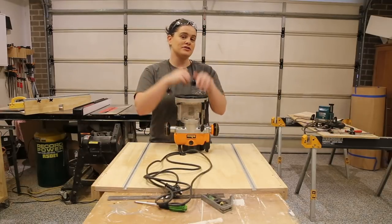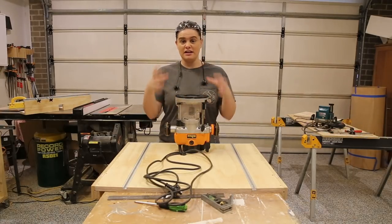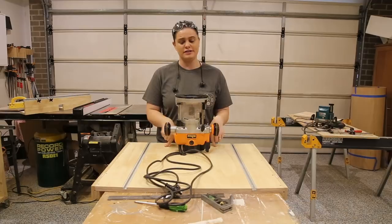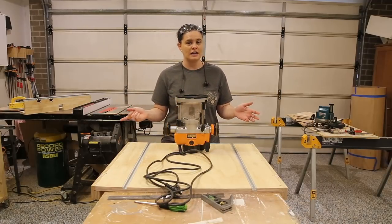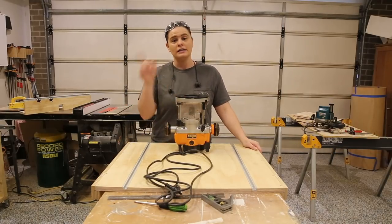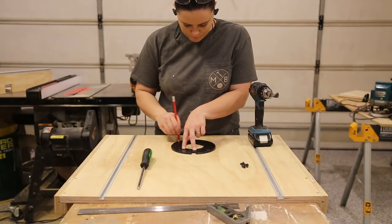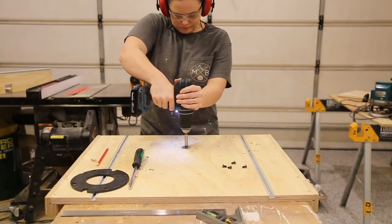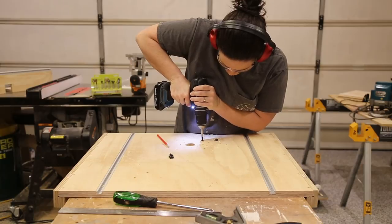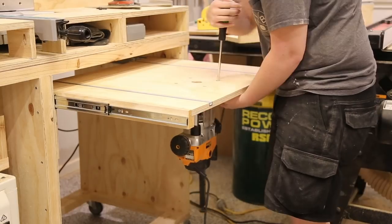The fence is all made and now we need to get the router in place. I'm going to use a Triton router. There are two ways to go about this: create an insert plate or simply bolt the router to the table. I'm going to bolt the router straight to the table — it's just four bolts, super easy if I need to take it out later. I started by drilling out the centre hole with the largest forstner bit I had and used a smaller forstner bit to countersink the screws below the surface, then a drill bit to finish drilling the holes for the screws. My router doesn't have very long screws so I had to countersink far enough for them to come through and into the router. It was then time to bolt the router into place and see if it all worked.